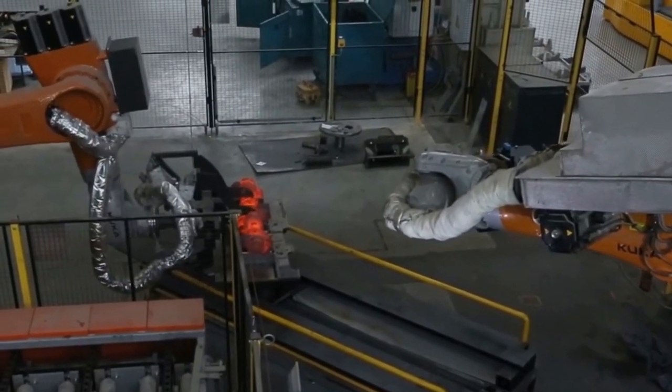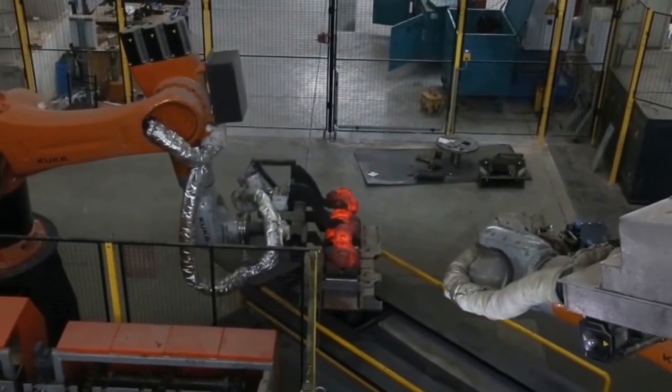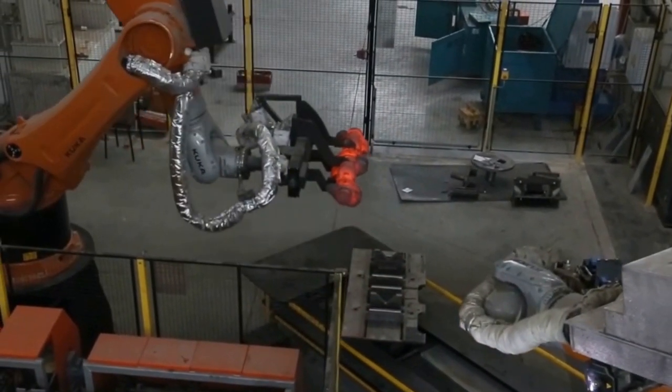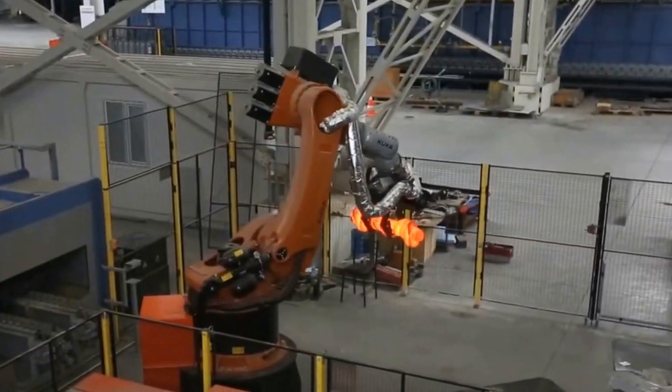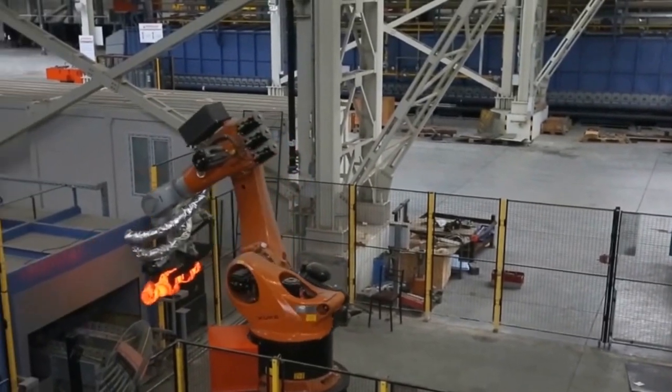So that's the calibration bit. It's falling through the cookie cutter, basically, and obviously just trimming off the flashing, which is the squished out material, because it has to go somewhere, right? You can only squash this and compress this so much.